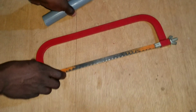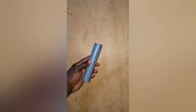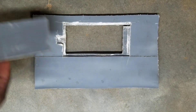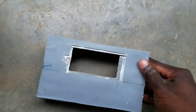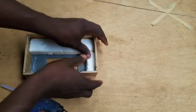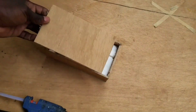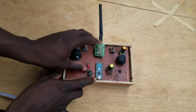Make the cover. To make the cover of this transmitter, slit the PVC pipe, flatten it, cut it according to the size of the electronic board, and remove the part where the battery is inserted. Then glue some plywood to the edges. Then glue pieces of depron to make the battery compartment.